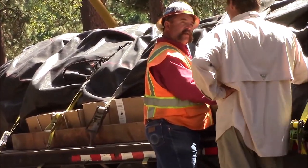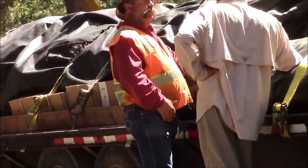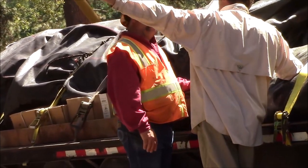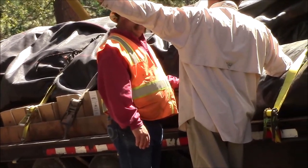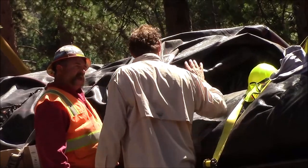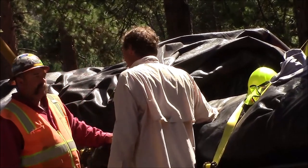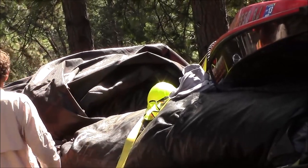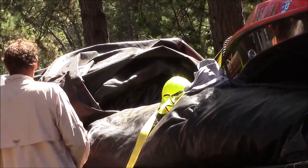When the plastic comes in contact with the stream bed, it is hoped that the suction of the water passing through the broken stream bed will suck this liner down and help to seal off any water that's piping into the work area beneath the AquaDam's reach.